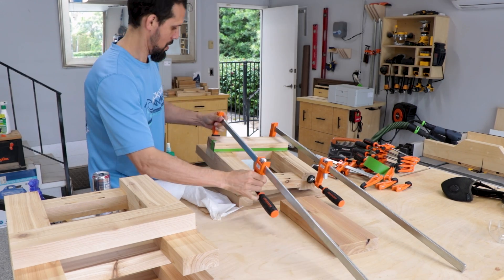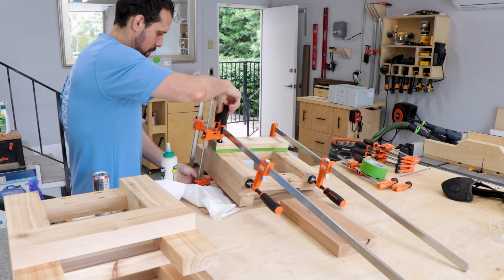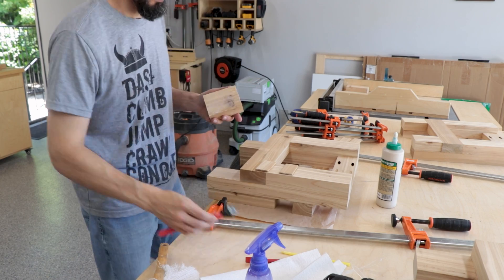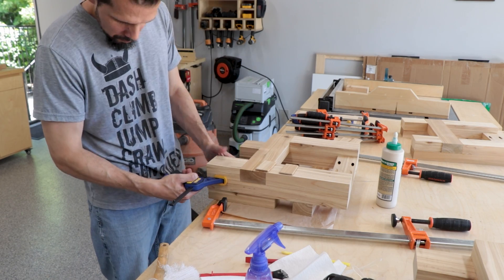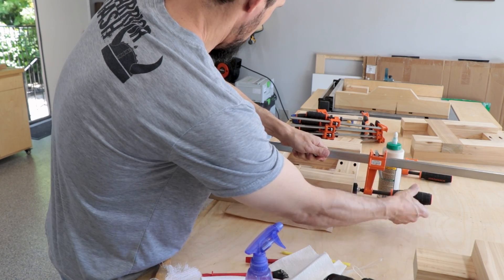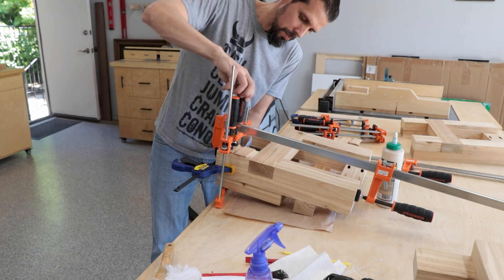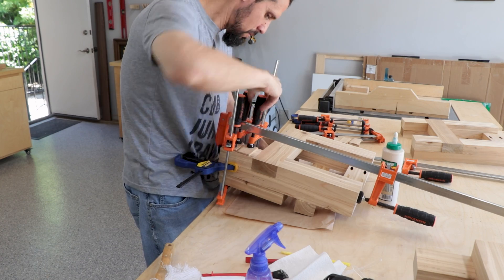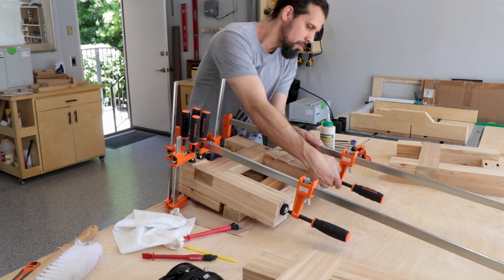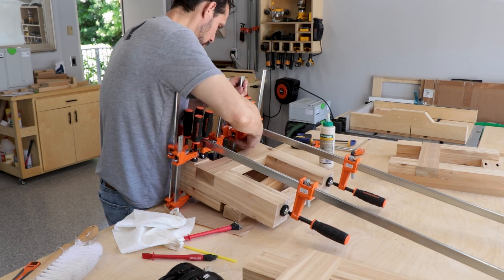For these pieces I clamp it first to the upper piece to make sure that joint is nice and tight, then clamp it down to the leg assembly. Once that's dry we pop those off and do the final piece on the lower end of the leg assemblies — same as before, slide glue on both sides, clamp to get the cross piece joint seamless, then do the same thing to the other side. After doing this three more times total we took them out of clamps.